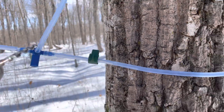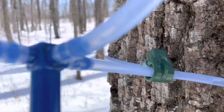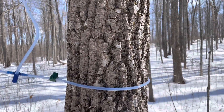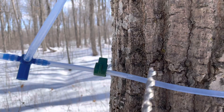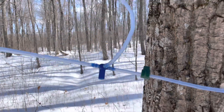So I put this on so that any bacteria or anything that collects in this line — and a lot of it would — can't make it past this tee. You still have a way to secure the end of your line around the tree with the end-of-line hook. That's just physically holding the end of the sap line to the tree. The blue tee takes the actual sap out without any cross-contamination from whatever is in that end section of line.